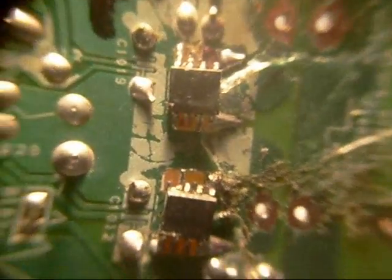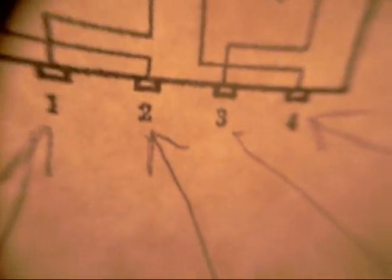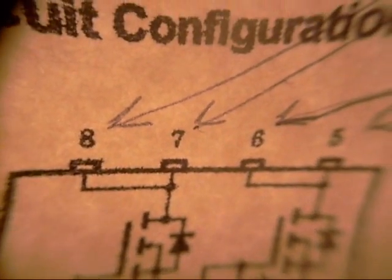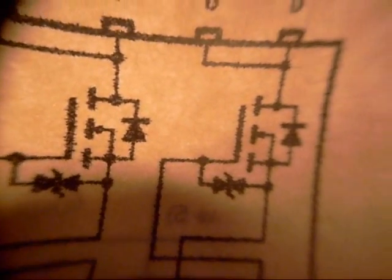It's really nice when you have a bad component — all you do is put the numbers in a search engine and you can locate the components. It's especially helpful when they have a pinout showing you the internal wiring of the IC, so you know how to test it for shorts. In this case, it shows you where the drain, gate, and source are. Sometimes you can avoid buying a schematic just by looking up a pinout of a particular IC online.